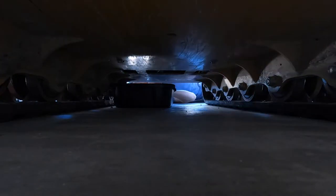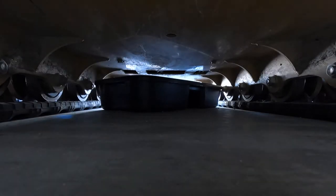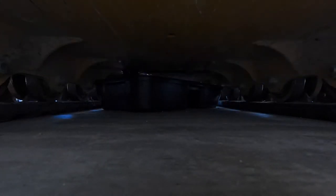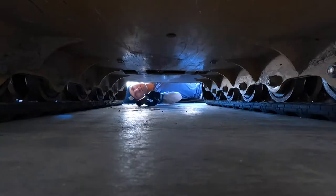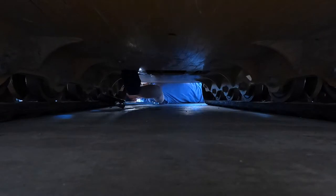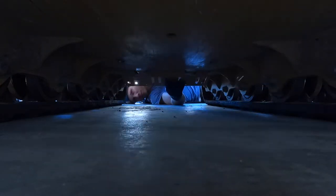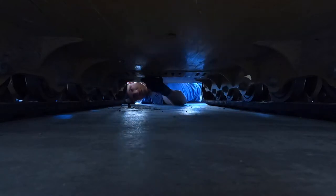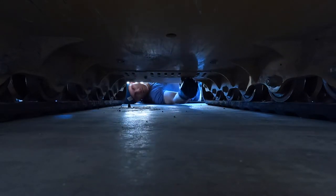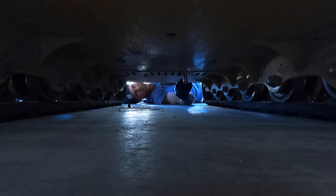After it's all drained, you have to slide your finger in, get the drain bolt threaded back on without getting oil everywhere. Once that's done, remove the pan and get the 7/8 inch deep socket back on with the breaker bar and tighten it up snug. Then put the skid plate cover back on, align it, and ratchet the 13 millimeter bolts back on nice and snug.